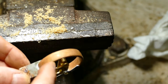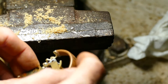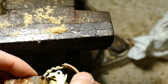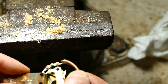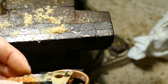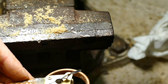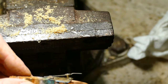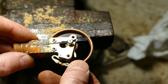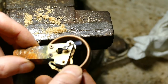That's how it works — this is hollow. Water goes in through the orifice, goes into this tube. This is a tube, and then the more pressure, the straighter it gets. As that straightens out from more water pressure pushing it to go straight, it moves the needle. Very clever. Water goes through here into the tube — the more pressure, the straighter that goes, and it moves the cam and moves the needle.